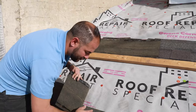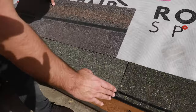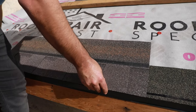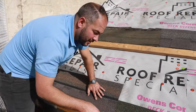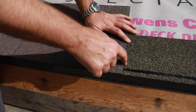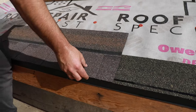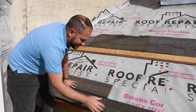Now our first piece of shingle — we have to make sure we're properly overlapping it. We cut the first piece of starter strip, and the reason is we never want that joint to align because water will pass through. We always cut the starter strip six inches so that we have a proper overlap of at least six inches. We also want to make sure that we don't have nails installed in our starter strip at that joint — any water coming into that cavity will bleed through the nail head. Thankfully, we've properly installed our starter strip and we can install our full piece of shingle.